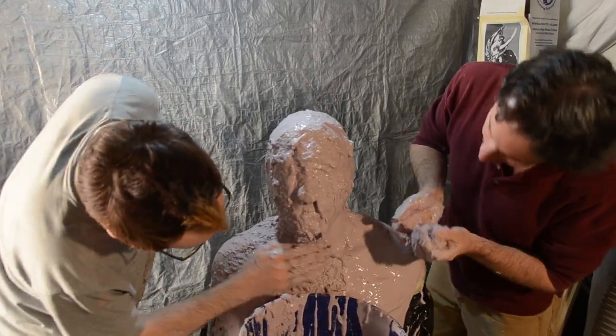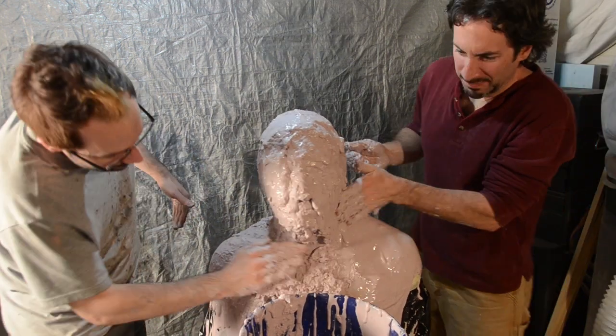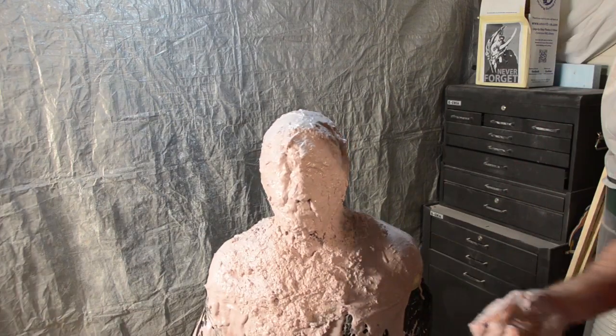About five minutes in, you'll notice the alginate start to firm up a little bit. Once that starts to happen, your clock is ticking. Make sure the thinner areas get covered as well as you can, and then once it sets up, you're done — just stop. You can't pile it on. Once the alginate has set, you can't mix up another batch and add it on later; it will not stick. Now that your friend's head is completely encased in alginate, make sure they can still breathe and that they're doing okay. This is also a wonderful time to have an alginate fight with your brother.